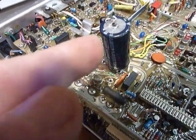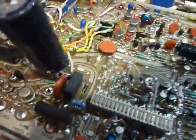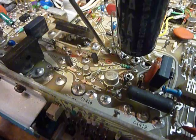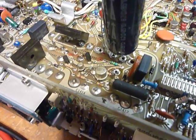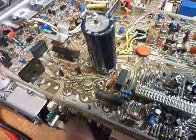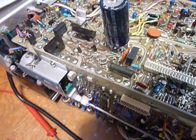I took the capacitor out and put in this temporary capacitor and found I still didn't have any voltage. Looking right down here next to the screwdriver, you can see two little red dots — those are connected to the transformer winding. I checked there and had 10 volts AC present, but nothing coming out of the rectifier assembly. I thought, 'Oh my gosh, I've got a temperature-sensitive intermittent silicon bridge rectifier.'